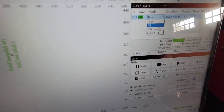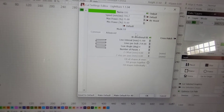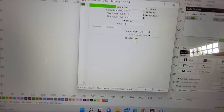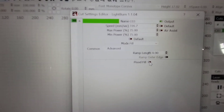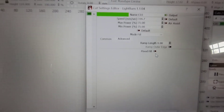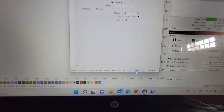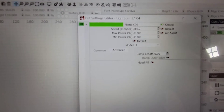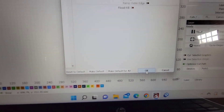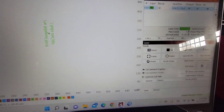The tape is off. Back in LightBurn I'm going to change from line to fill so I get full fill on my text. I'm also going to double-click to check power settings - mode: fill, bi-directional fill. I want to turn flood fill off because I've noticed that if the laser engraves all the way to one side and skips a part and has to go back, it will miss segments and pieces won't line up. Turning flood fill off usually avoids that problem. I forget to do that sometimes and mess cups up. My power settings are 316.7 millimeters per second at 35% power - yours may be different depending on what you're doing, what kind of cup you have, what color the cup is, and the machine you're running. Hit okay and send it over to the machine.